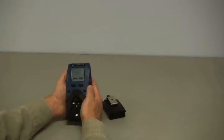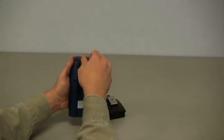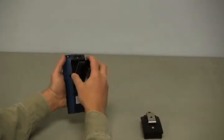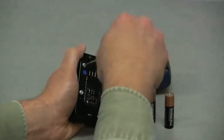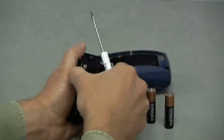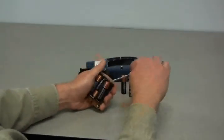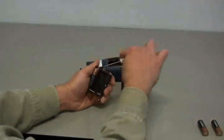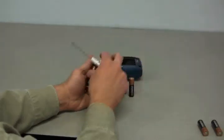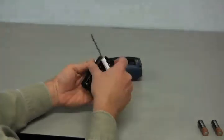The PHD-6's batteries are housed in easily removed battery packs. The rechargeable lithium-ion and alkaline battery packs can be used interchangeably; the instrument automatically determines which type is installed. Low battery alarms warn when battery voltage is too low for safe operation. The alkaline battery pack holds three AA-sized disposable alkaline batteries. To access them, turn the two screws on the front of the battery pack one-quarter turn counter-clockwise. Use only Duracell MN1500, Duracell Ultra MX1500, EverReady Energizer E91-LR6, or EverReady EN91 batteries. Substitution of batteries may impair intrinsic safety. Be sure to align the battery polarities as shown in the battery pack.